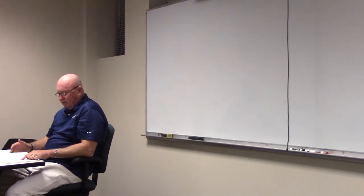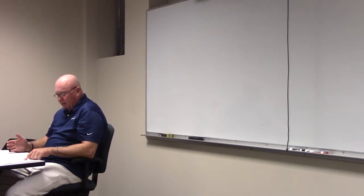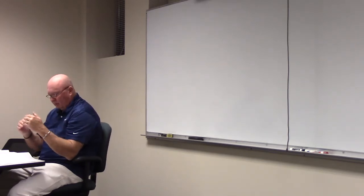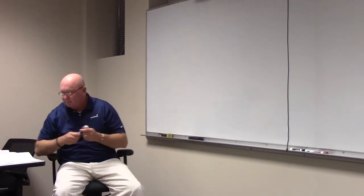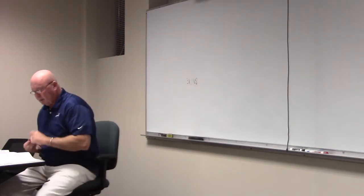But now here's the difference. Look at what we do with the range. On the regular method, that would have been 8,000, wouldn't it? But now it says nameplate. Nameplate is actually what's written on there. So it says it's a 12 kW, so that becomes 12,000. A dryer, it says it's 5,500. We list it just like it is. The dishwasher, 1,250. The disposal, you have to go to your motors. Well, matter of fact, it tells you there. So it's 1,176. The attic fan, it tells us it's 1,656. And it tells us the blower motor is 864. So we just take all those, we add them up. 31,818.